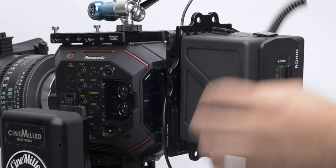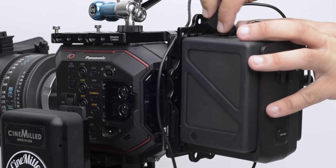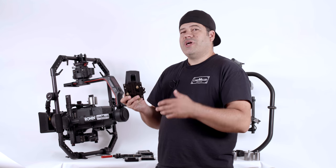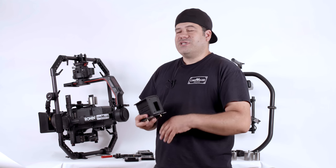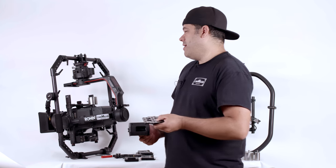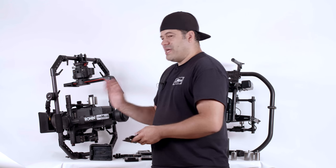Essentially, it allows you to click into a gold mount. For example, if your camera is on the tripod and you have an Anton Bauer gold mount on the back of the camera, you can now slide into that, and via the P-TAPs you can power the camera and accessories. This essentially lets you use your Ronin 2 batteries to power your camera when it's not on the gimbal, so it gives you more bang for your buck out of your Ronin 2 battery investment. I know now I'm using the Ronin 2 batteries all the time for all of my setups.